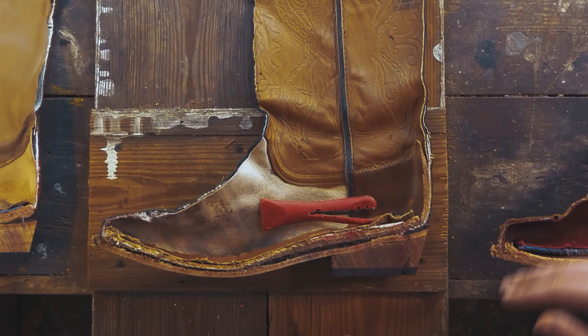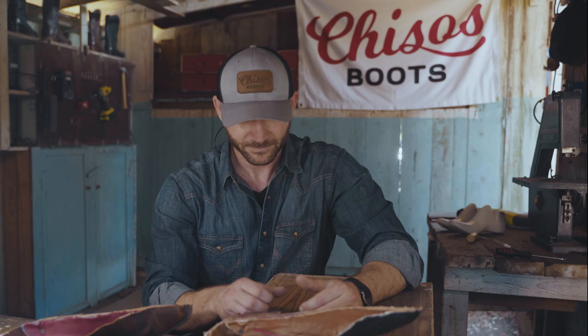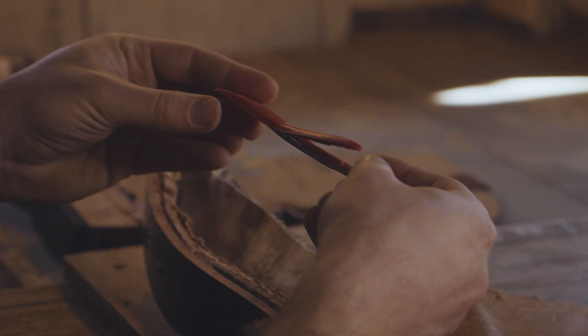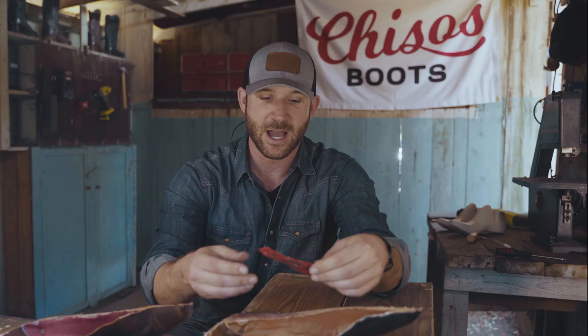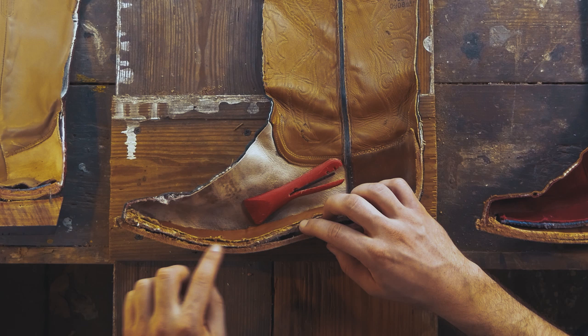Stacked leather heel. One thing that's interesting is the angle of the heel on this particular pair is much sharper than on the other two. And then we get to the shank. Now, something funny happened here. It is a steel shank, now completely dipped in plastic. And when cutting into it, we got about maybe two-thirds of the way through, and then it actually broke loose and was dragged through the boot until we realized what was happening, and stopped and pulled it out. So an interesting thing to have happen. Strong shank, however, the connectivity to the rest of the boot, perhaps a little lacking.